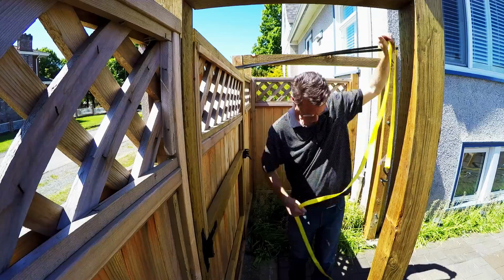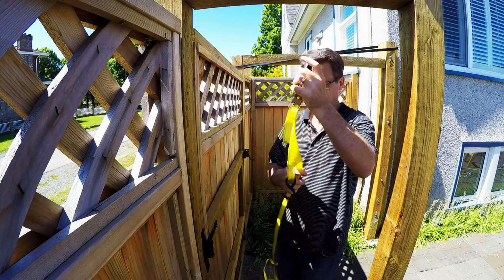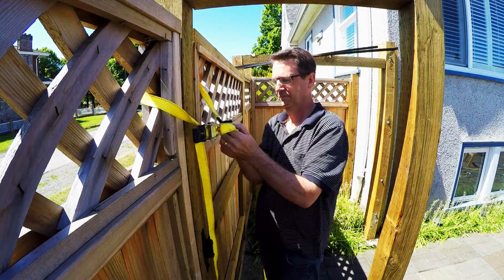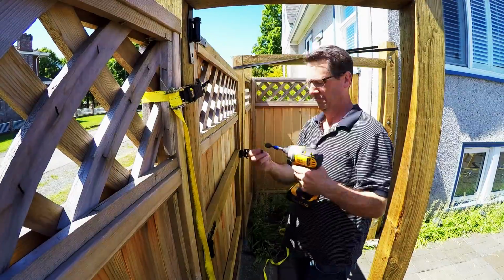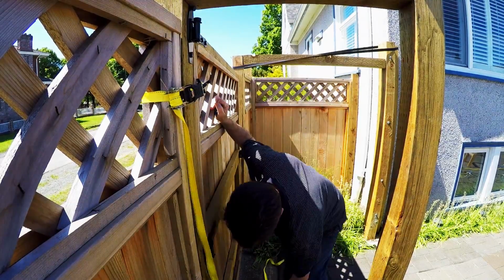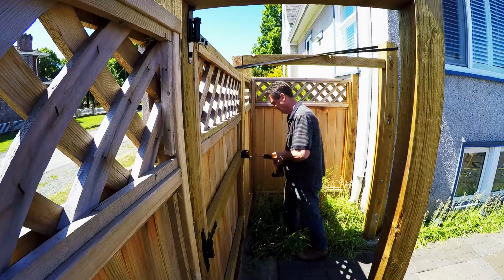No need to take down the gate because we can use the ratchet strap to pull the gate tight to the fence post. This is a very simple process. Feed the strap around the gate and the fence post, and then tighten it up and pull the gate tight against the post. Once that's done, add the extra hinge by bolting it to the gate using the impact driver. Another handy tool to speed up the process. Then, just a quick adjustment to the gate latch because we lifted that side of the gate a little, making the latch not able to lift.